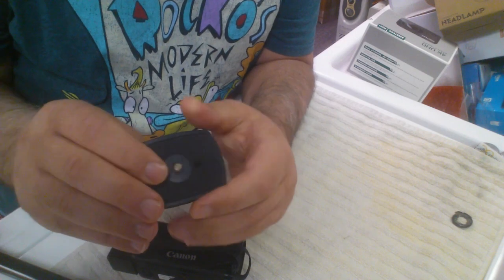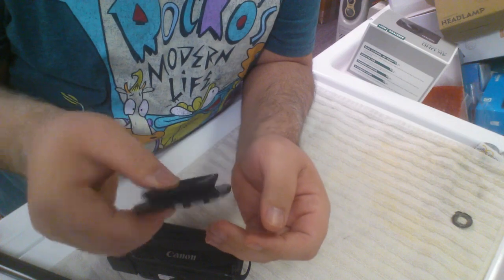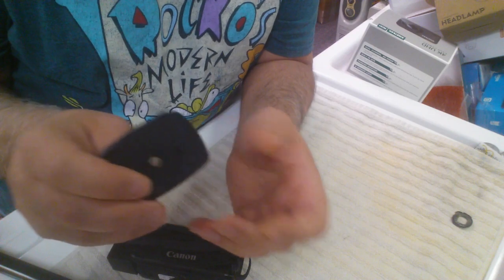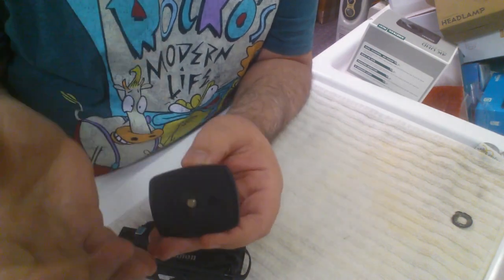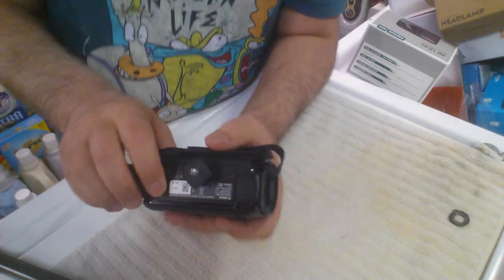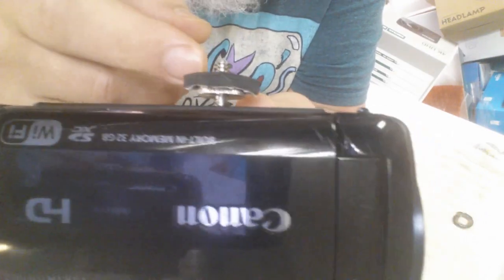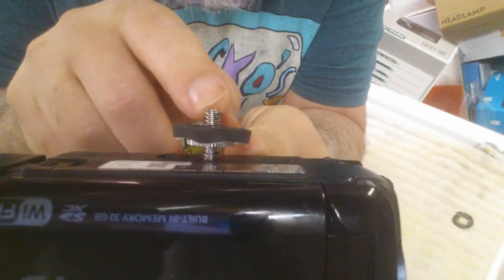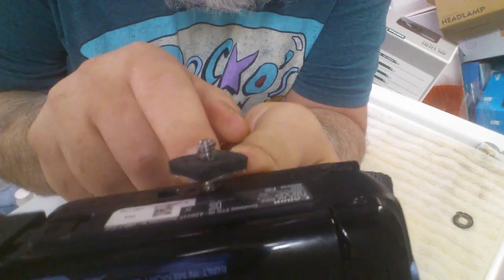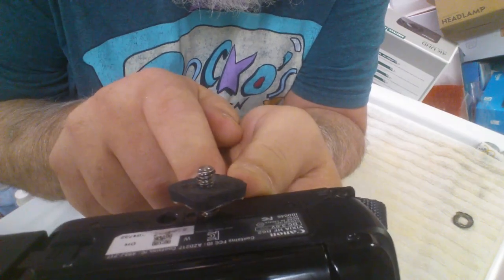And the locating pin sort of locks the camera onto this plate. Well, this cheap tripod, the plate wouldn't sit nice with it located. So I'd always put the pin off to the side, so I didn't use it anyway. It wasn't a big deal. I had, if you look close here, this metal thing, ignore the black thing for a moment, and that's 1/4 20 by 1/4 20, male on each end. That seemed to screw in, and that worked for 3 times, and that stripped out.